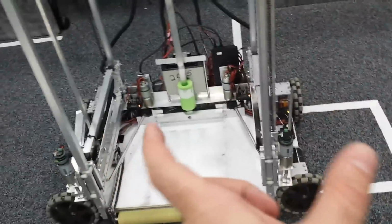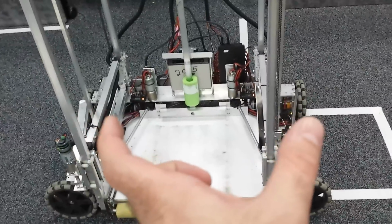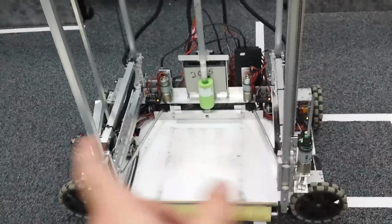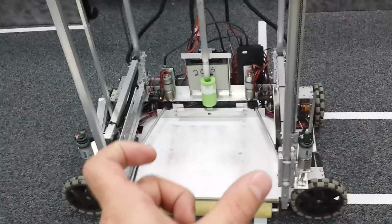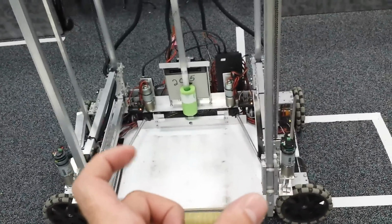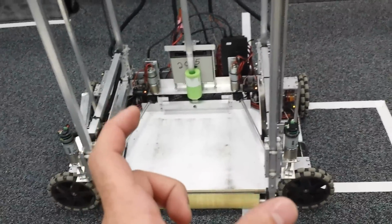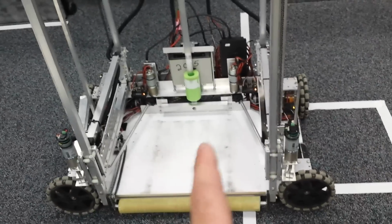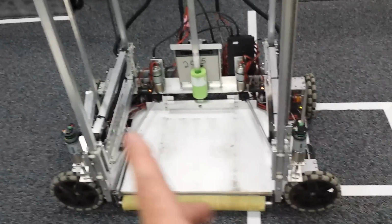And again, the other way to do it, which is a combination of what I do, is use active feedback PID control to keep its orientation locked. And you could either use a gyro or a compass or some other IMU system to give you an external heading. So as the robot rotates, it has a reference heading, and it could automatically apply a counter rotation to always keep it locked to that orientation. So there are still different approaches you can take to maintain your heading, but that's just some of the approaches we've taken, and it seems to work well enough for us.